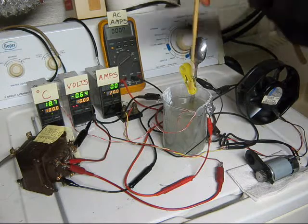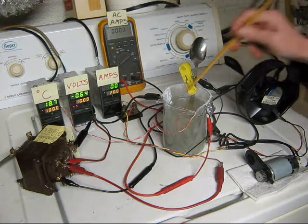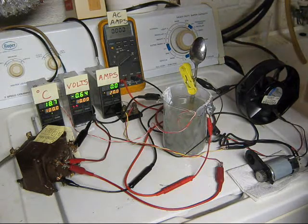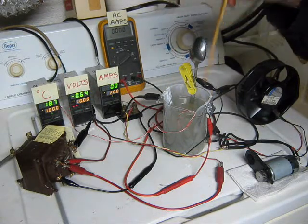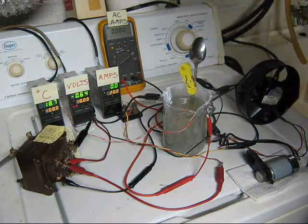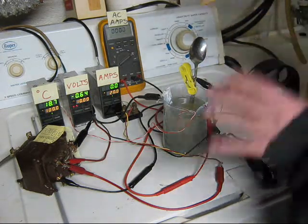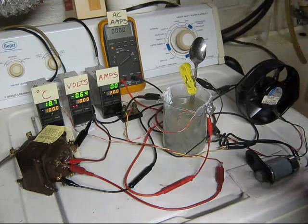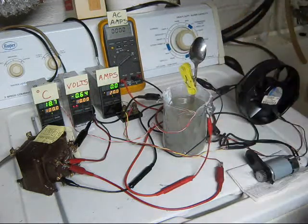What we're looking at is an electrolytic cell here. Electrolyte, obviously, some liquid in there. It's not toxic. I can eat that. If you've got a sour stomach, it'd help. Two plates of aluminum foil here, one here, and a cheap Chinese-made stainless steel spoon with the handle stuck down in there. We'll get into why this is set up the way it is later. But what this is intended to be is a full-wave rectifier made essentially from two electrolytic capacitors, all in the same cell.